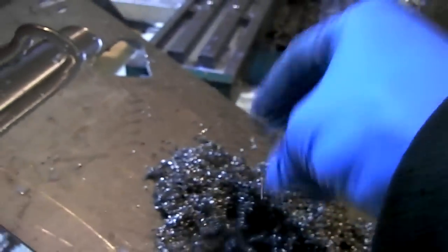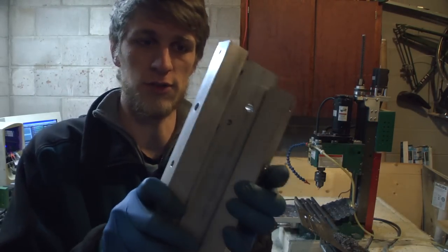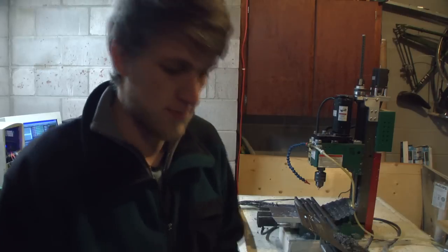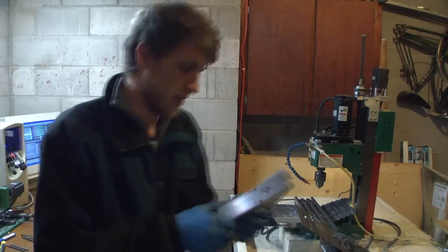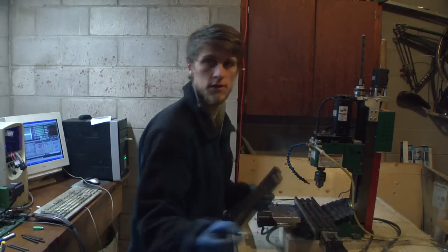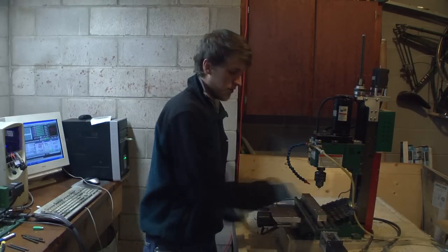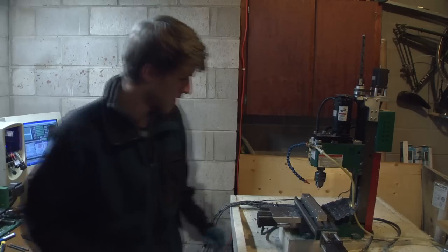Very weird, but awesome. All right, next little project is to make use of all these chunks of aluminum. This is a new fixture that I'm making. It's called a soft jaw. And I see the middle piece, it's got four locator holes that fit perfectly into four pins that I have on my table here. So this thing will be pretty repeatable. I'll be able to just dump it down there, and it doesn't wiggle at all, so it's as zeroed as it's going to get, really.